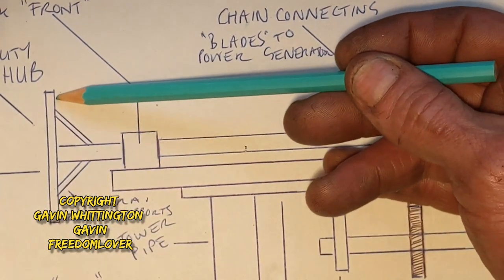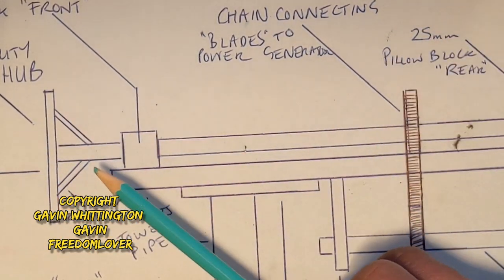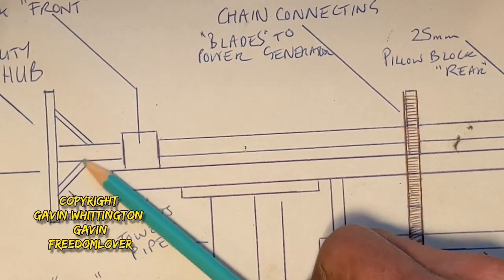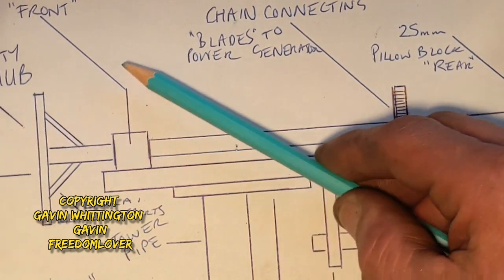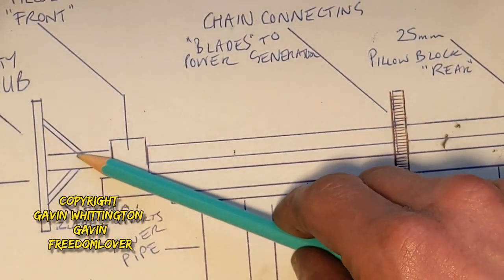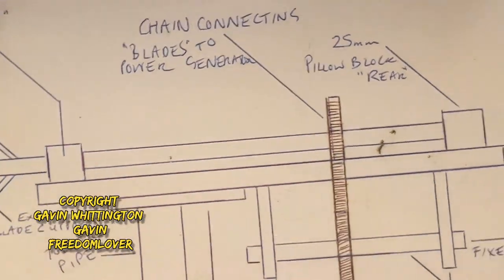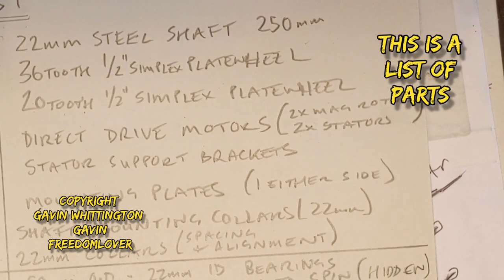Big blades — it'll need a 30 centimeter hub, at least six or eight mil thick. Then I'm going to weld on some arms, and there'll probably be another collar here. So there'll be one big thing that will slide over with like a pyramid of sort of 10 mil steel bits. That's just some of the parts you will require.